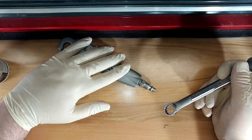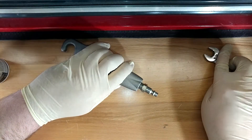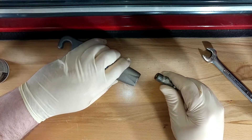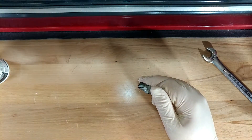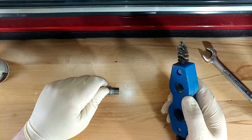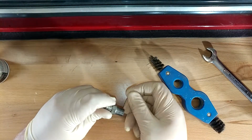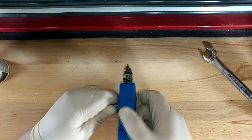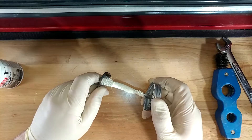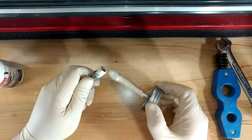Since there is nowhere to put a wrench on it, I'm just going to try and pin it down with my forearm while I take the fitting out. And this is Teflon tape — I was hoping to show you guys how to clean off old Teflon tape. It almost looks like there's basically none on it. Maybe I just did a really crap job here — well, we know I did a crap job because it leaks. Teflon tape with the wire brush works a lot better, particularly if you use a powered wire brush on a bench grinder. There's basically like no Teflon tape on that. I don't know what I was doing. Anyway, we've got our fitting cleaned up, and I'm going to pipe dope it.